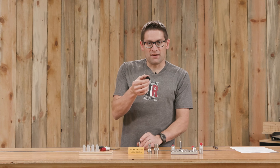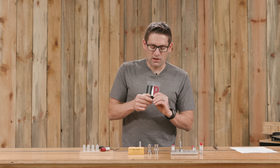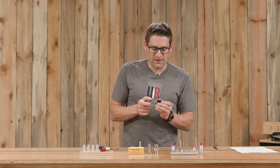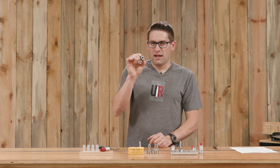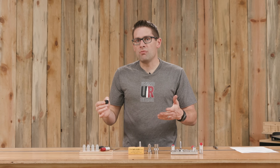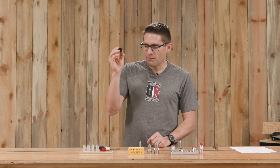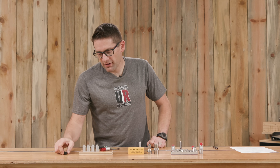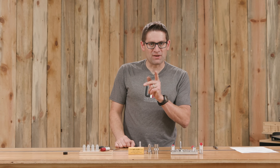While this is plastic and not a completely precision drilled surface — you can see a little bit of lines there from the injection molding — in a pinch you can get a rough number. For an AR-15, you might be pushing the shoulder back four or five thousandths of an inch when reloading, and this would be plenty accurate for that. If you're in the bench rest game, probably not.